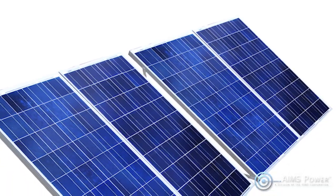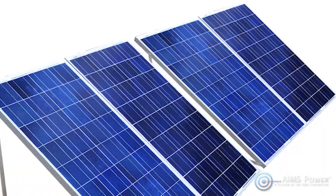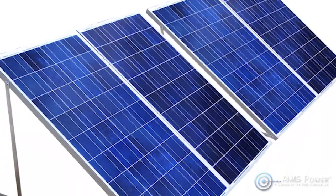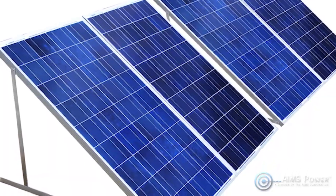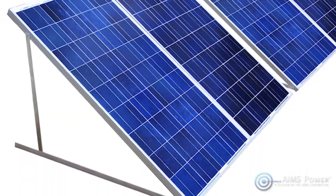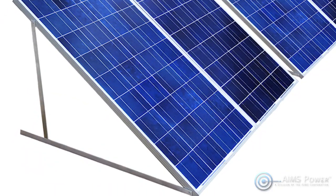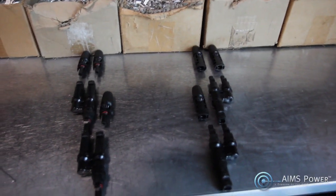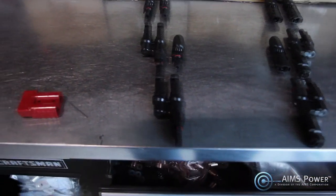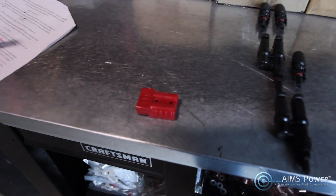You may choose to utilize the inverter's 60A solar charge controller. This inverter is designed to use a maximum of nine 120W solar panels, series together in sets of three for maximum power output, producing 60A at 24V — equating to roughly 1440W of total power output on the brightest, coldest day. Three sets of panels are wired together in parallel utilizing MC4 branch connectors, and these panels input directly into the inverter through the Anderson SP50 connector.